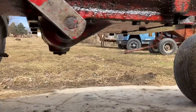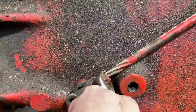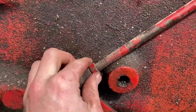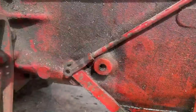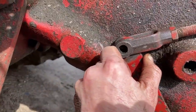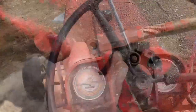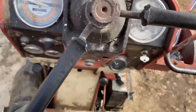That's the plate that needed to come off. Now we can see the linkage is adjusted way too far out, so we grab a three-quarter wrench, take the jam nut loose, and spin the clevis back up to pretty close to where it was — where the paint is worn off. We adjust it to the point where you can just get the pin in, not pushing in too hard, because when you push the clutch in this will move.